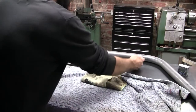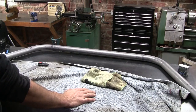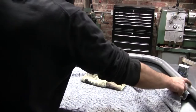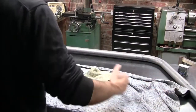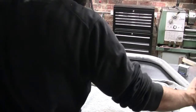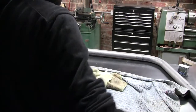And I also bent it back in this direction and shortened. This looks like the bending radius is slightly larger than the 152.4 that it should be. But now measuring from the start of the next bend across, I've got the correct dimension lining up with CAD. So now it's a matter of bending these legs square to this top bar. I'll probably bend them a couple of degrees short on each side, just so I can tweak the foot distance and get that exactly right.